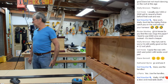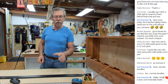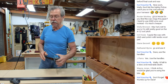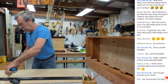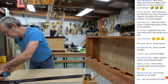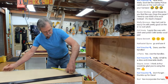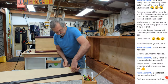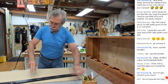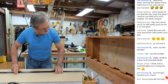Now at the back, I will possibly use, I'll make the back 10 millimeters no matter what type of timber I use, because the back's not going to be as important. So I'll come back 10 millimeters. So the front was 167, so it means I'll come back 157 from the front. 157, and that will give me a 10 millimeter section there. 157. And then the ends, I think I'll also do 10 millimeters.